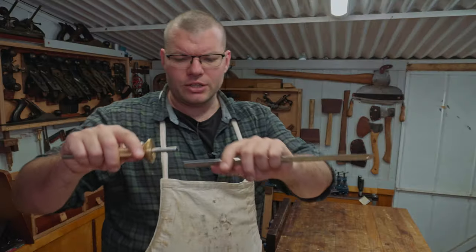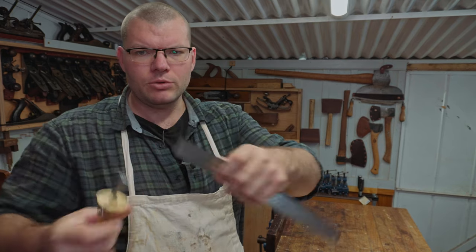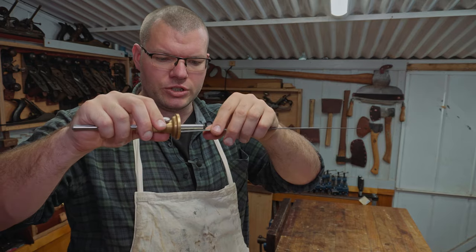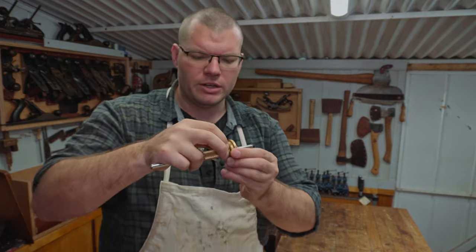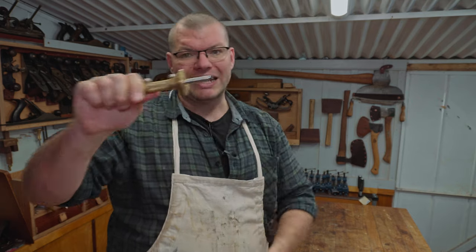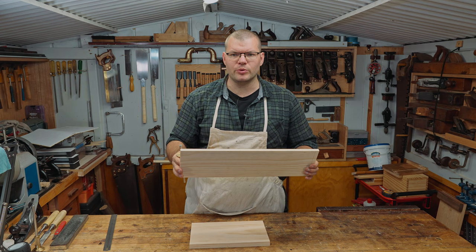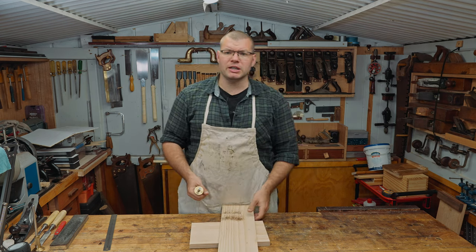To mark this out I'm using a ruler that has etched ridges on it, which makes it a lot easier — you can just drop the cutter straight into the little ridge and you're going to be very accurate. So let's jump down and I'll bring you in and we'll quickly wrap a line around this board and get to cutting it in the vise.